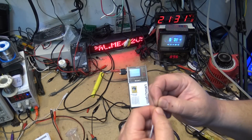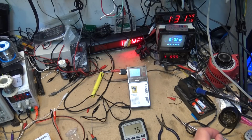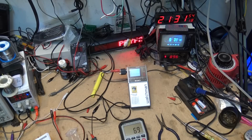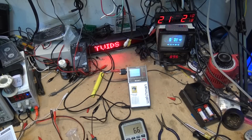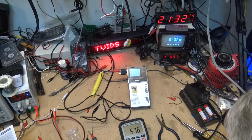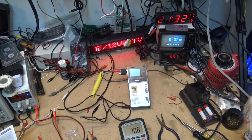This is a thermocouple, right? So I was just touching the tip of the iron. I think maybe if I were to get myself a little pool of solder and stick it into there, we might get a better reading, because I was just making contact with the tip. So we'll try that. I'll get a little ball of molten hot solder on the bench here, and we'll dip that and see what it goes up to. It looks to be about 700 degrees.